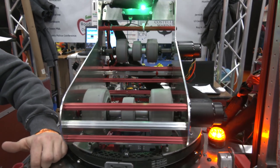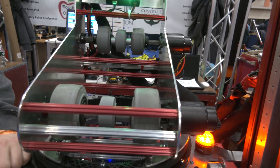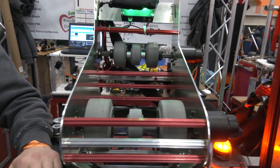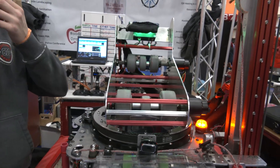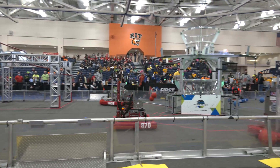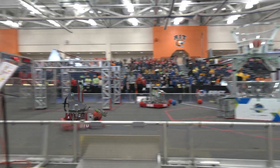It gives you the versatility you're looking for. I want to ask about your Colson wheels — it looks like you have some larger Colson wheels with smaller ones on the inside. When you were testing, how did you figure out that was best for channeling the ball? We started with just two, but as the ball gets compressed this one doesn't do much, but a little bit of contact on the smaller one helps with the backspin and how far the ball is going to travel.